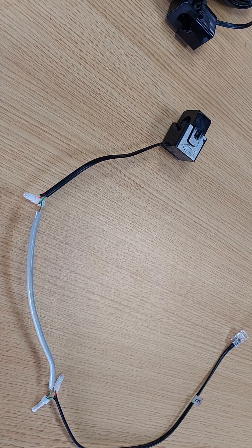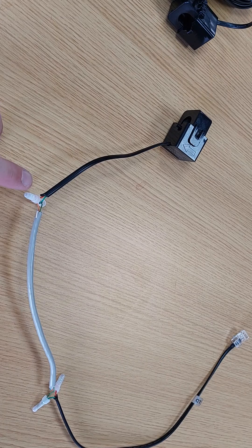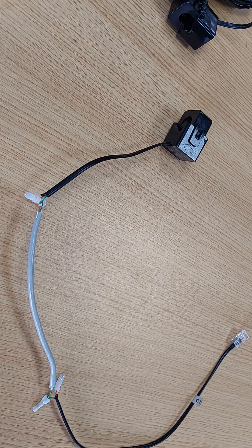If you are getting a reading, use the provided crimping caps which we supply in every Lux. It's as simple as that — to extend a CT clamp, use cat5 cable and the provided crimping caps inside the box. Do not use Wagos, do not use gels — these will cut the signal from the CT to the Lux.